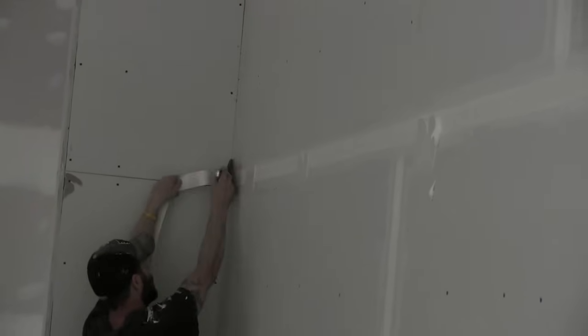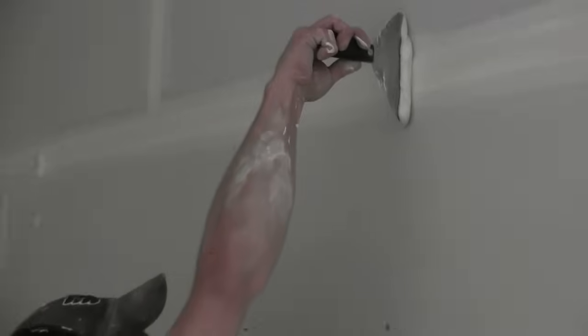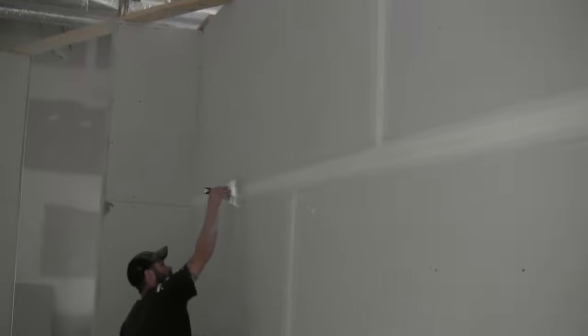And if you're an amateur like me, I just do short sections at a time, which still works out the same. In the middle, and work your way out. Explain what you're doing right now with this. All right, you can see I've wiped it. The bevel is a little hollow there. Not 100% necessary, but it does make it nicer when it's time to coat. Fill that bevel up. Okay. And this is what the tapes look like. Now, I will finish off this last small flat and then run an angle tape.